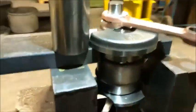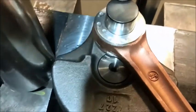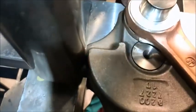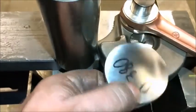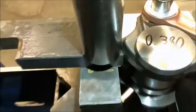Okay, we're here in the drill press and we got the first section assembled. I made this jig that fits around a bearing and it's machined flat. So what's happening is a little over about a third of the pin sticks beyond the bearing. We're going to use that as a stopper so it can't push the pin through to the other side. The gap in between the con rods, or between the plates, was 380 thou.